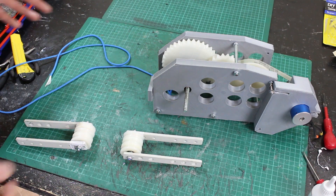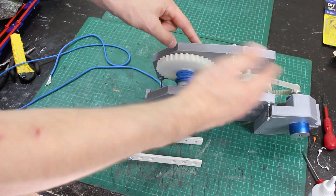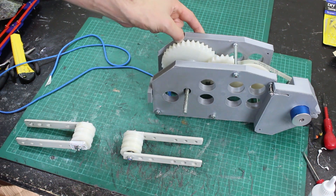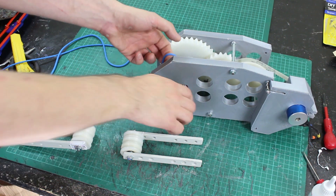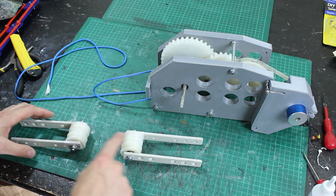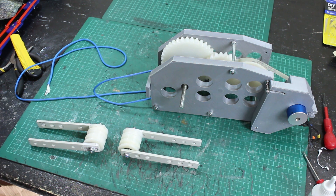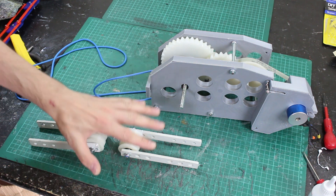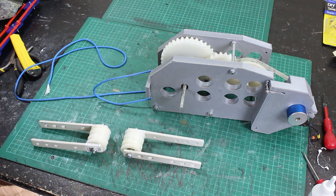To recap on the previous motor design, we had these 3D printed gearboxes which were pretty cheap. They've got nylon gears but otherwise it's normal 3D printer filament with cheap RC brushless motors. We had a cord on the last stage getting pulled and then we spread that load over blocks and tackles — the cord went round multiple times pulling these together. That's how most of the joints worked, and that meant we didn't have to spend much money on gearboxes while getting really high power tension.